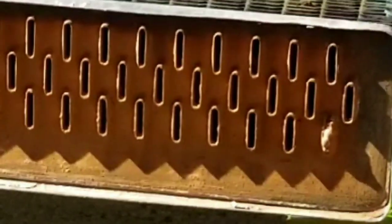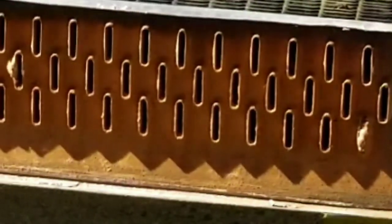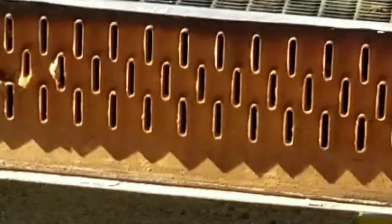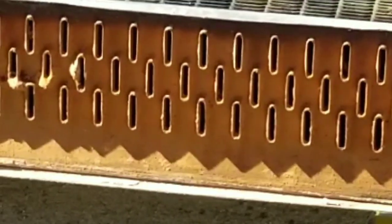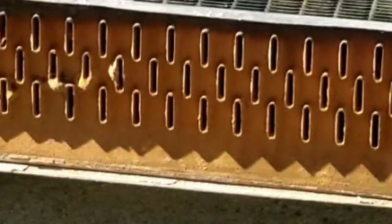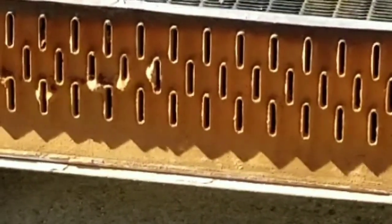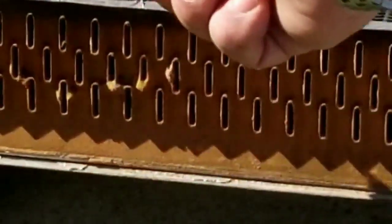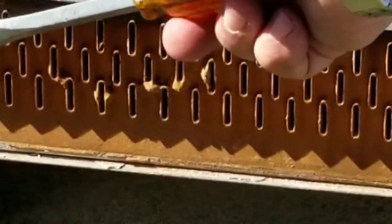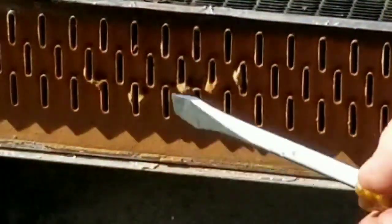So if we had a bad tube, and we have, these are pretty big, so on this type of radiator you can actually just solder the tube if it's mechanically sound. By mechanically sound, I mean it's not rotted, corroded, or totally demolished. But if we had to remove a tube on an automotive radiator, what we would actually want to do is clean out the, get to the tube at the header. This end is called the header. Those are called the tanks, the header, the core, the tubes, fins.